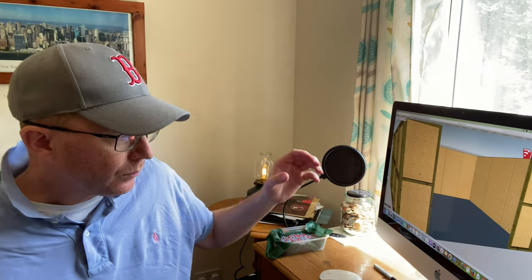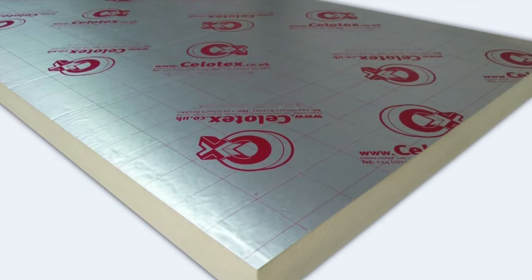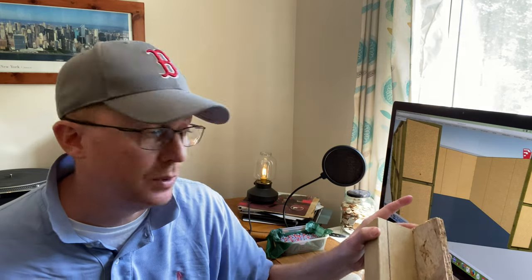The question I have got, though, is in regards to the insulation, and I'm hoping somebody out there might be able to help me with it. The insulation itself, which is going to be the 50mm Kingspan, is going to have to go in after the modules, after the boards have been put up. So if I look at, say, something like this as an example, just a quick mock-up here. There's the 11mm OSB and there's the 3x2. The black line represents the width of the Kingspan. So there's not enough room for me to secure the fixings in because I want them to go in the middle. So they'll have to be fixed to each other.